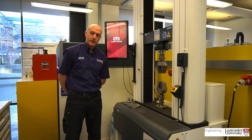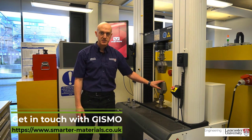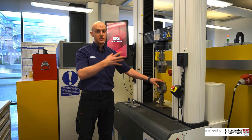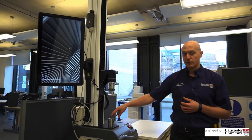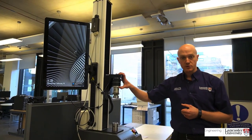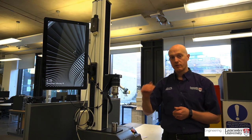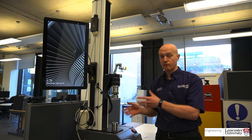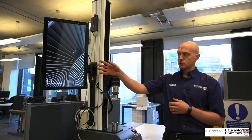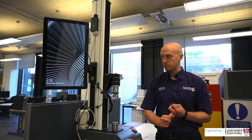This is our Instron 3382 — one of our brand new testing machines. It has a 100kN load cell and enables us to test in tension and compression. We've also got different rigs that we can fit to this machine, so we can do 3-point bend tests and 4-point bend tests. We can also input different outputs and inputs into the machine to test different pieces of equipment. This is our other brand new Instron testing machine — the 3345. This enables us to put different load cells onto this machine; at the moment we've got a 5kN load cell, but we can also put 500N and 100N load cells. So we can go down the range to achieve better accuracy when testing components. Again, this enables us to test in compression and tension, and to put 3 and 4-point bend tests on it. The controllers utilise Bluehill Universal software — the latest testing software — which provides graphs, Excel data sheets, and everything from that initial test.